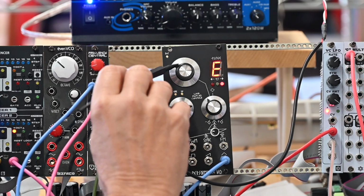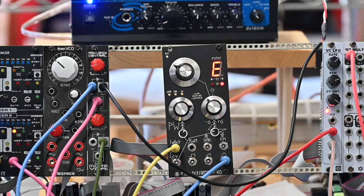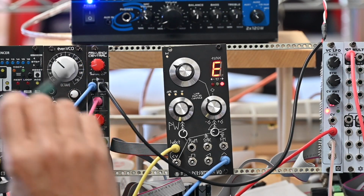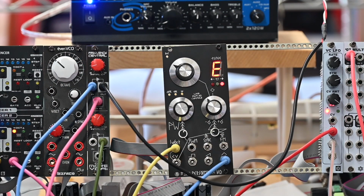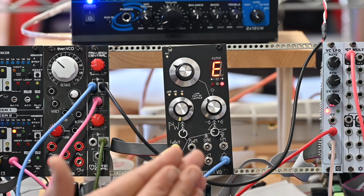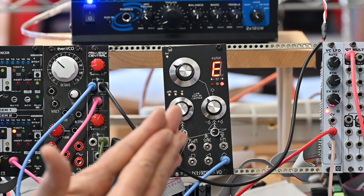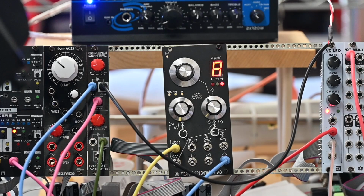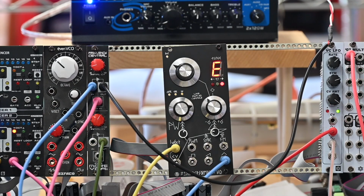This switch, as you saw, was a little bit of a pain, but just take it slow. And again, I'm not sure why he didn't want that pin header soldered in. I personally recommend you do that just because a simple metal-to-metal contact is failure prone. But that's just my opinion. You can do whatever you want to do, of course.